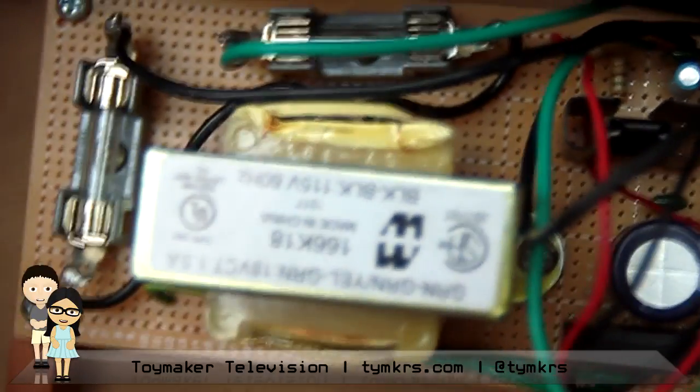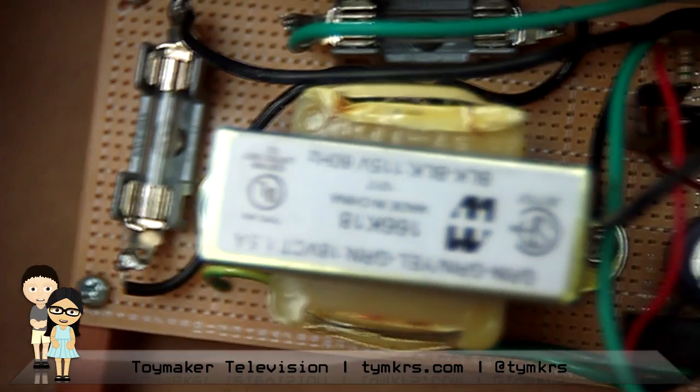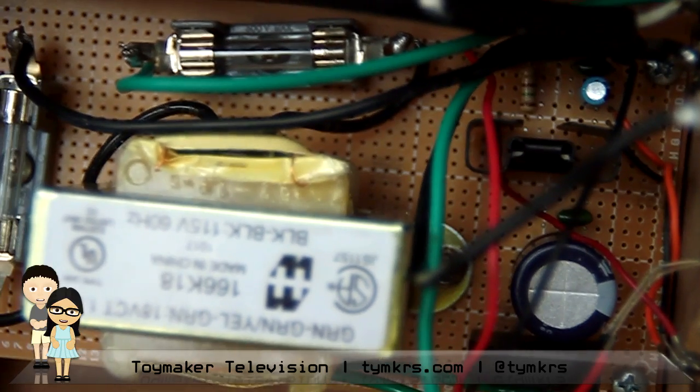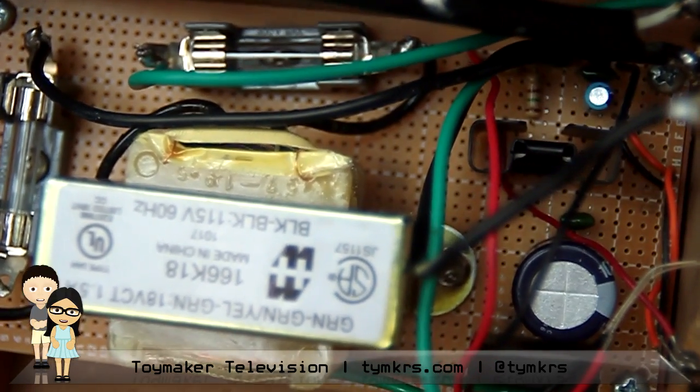Yeah, at 250 milliamps on the input, you'll never be going over 1.5 amps on the transformer, and that also is well within the range of what is normal for the regulator. But that gets complicated on the regulator because it's variable voltage. Right.